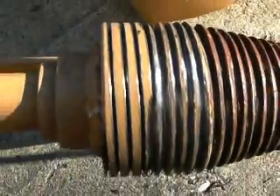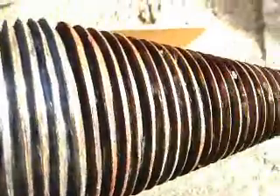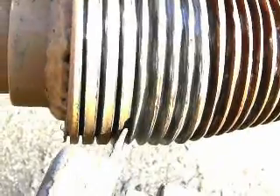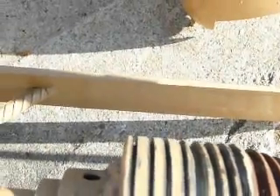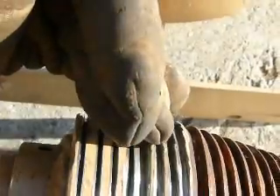I just cut more with the grinder — instead of just grinding, I really cut at the angle that I want to reach the straight groove that I did before. When I go with the angle, I reach the bottom of the straight groove. That's what makes one edge straight and the other one with an angle, then straight again and an angle, to be able to pull on the lug.